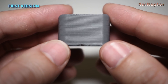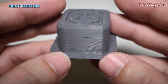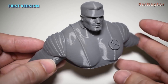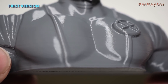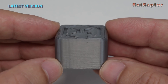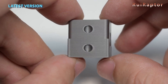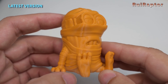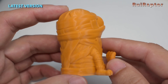As far as print results, on our first review we noticed that the print quality was okay, except for the uneven layer lines that were very noticeable. We ran the same test on this new version and we can clearly see that the quality has improved. However, you need to calibrate your extruder and flow multiplier correctly in your slicer. We found that with this printer we need to use a much lower flow multiplier value, such as 90% or even a bit lower, depending on the slicer.